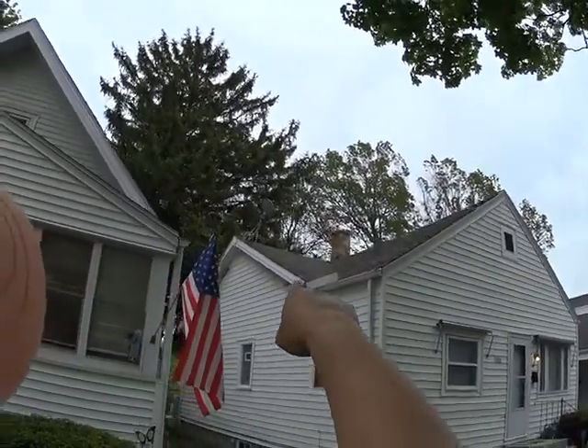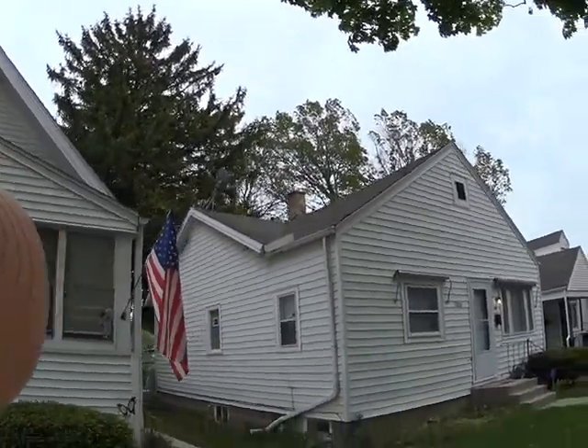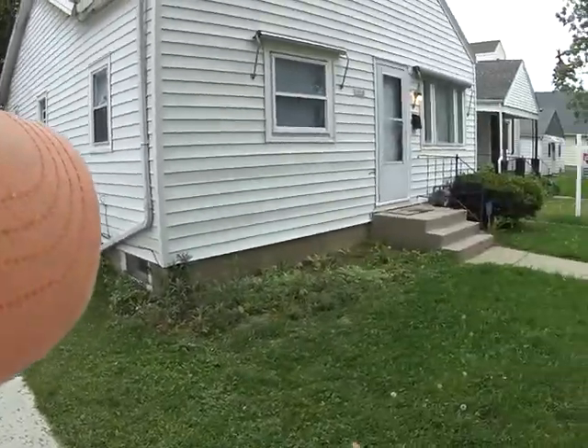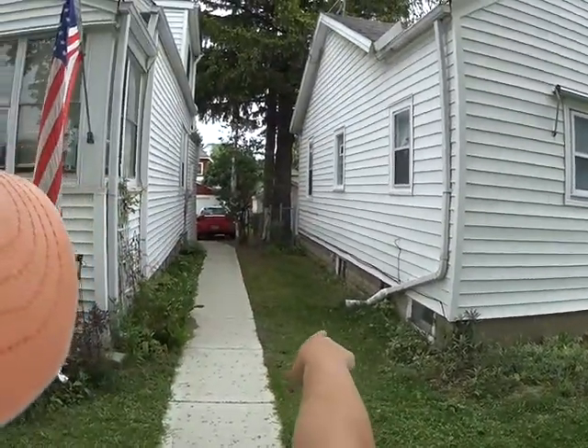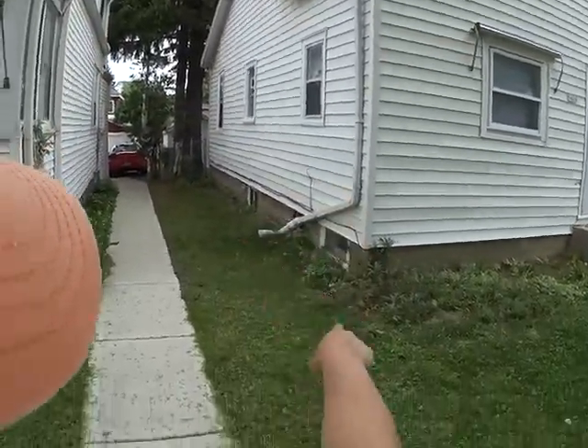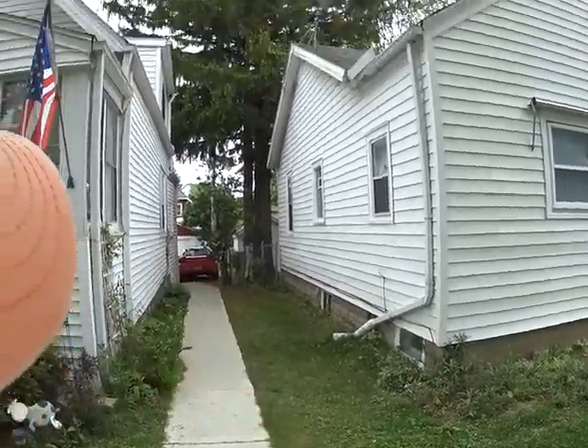The chimney is going to have to have a little bit of repair work up there. The roof looks good on this side. I definitely want to see some grading here, and definitely that drain further away from the house — maybe pull it further this way, turn it this way more instead of the back way.